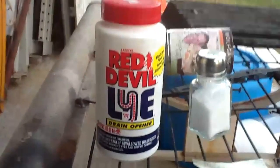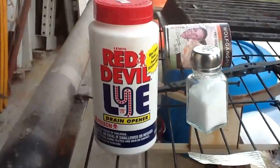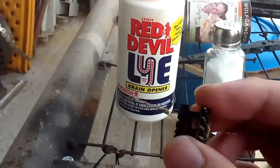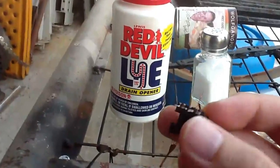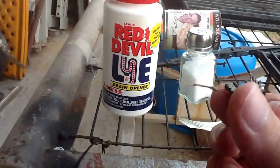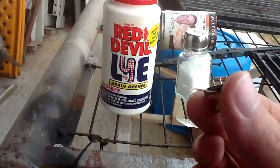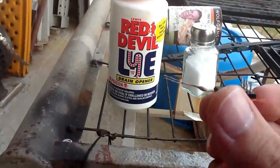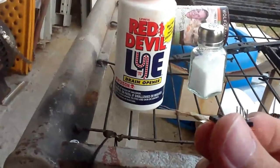Today I'm going to show you a trick that's real handy if you ever have to wind your own transformers, or if you ever run into a situation where you've got to strip magnet wire, especially really thin magnet wire like this. This is 34 gauge and there's not much metal in there, so if you try to strip it with a knife a lot of times you'll end up just cutting the wire right off, or you'll remove too much material.